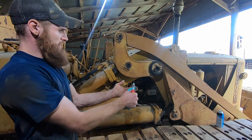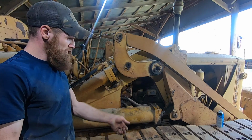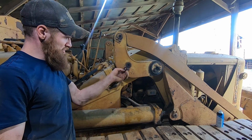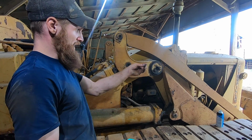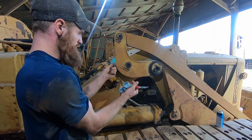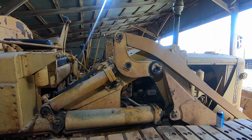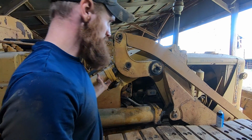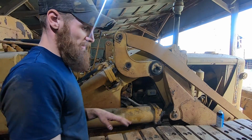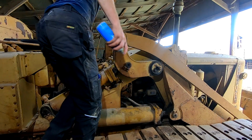All right, so I have tried my best to get the fuel bowl, sediment bowl, to seal. I need to figure out what kind of an O-ring this is and get it, or just bring my stash of different stuff, find something. Tried cutting some gaskets out of gasket paper, still won't seal. So I still want to try it. We've got the battery hooked up. We're just gonna try and get it to fire on ether and for more than a second. Let's give it a shot.